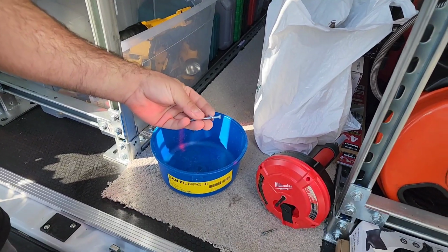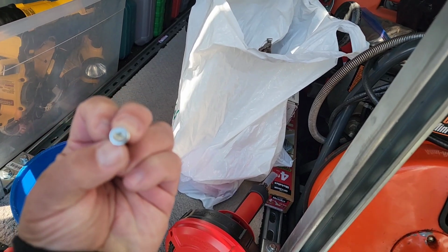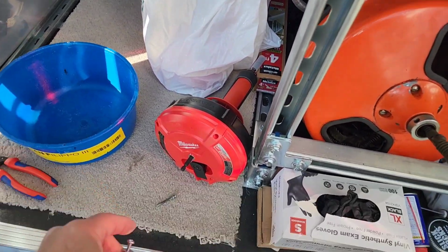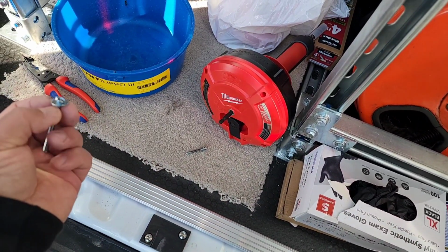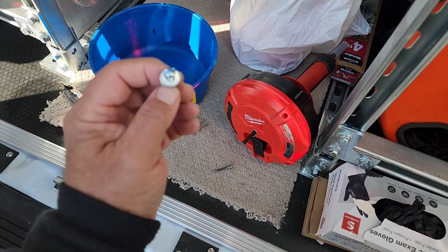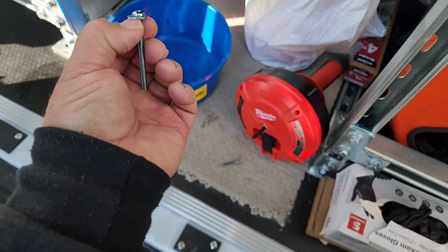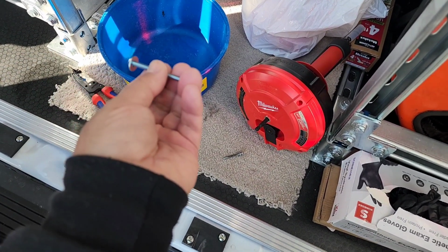Okay, I was running my mouth telling Vinny, we found a washer, as you saw right now, that looks like it'll go right in the hole and do the job. But Vinny wanted to know how I would grind this down. What I would do, I would not use the original screw. I'd get a fatter screw, put a nut on it, get it centered so it'll self-center, and then run it up with a nut and tighten it on there like a wheel. Put it on a drill motor so it spins.